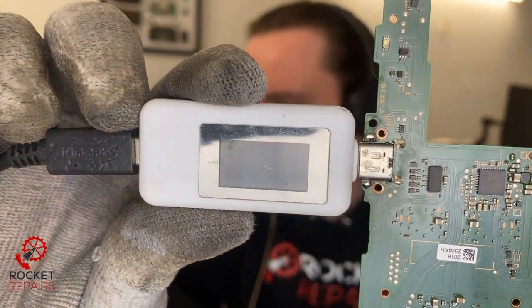Let's test. What we're looking for here is charging on both sides of the board at 15 volts. This side — yep, 15 volts, 0.032 amps. That's good. And the other side — yep, perfect. All right, 15 volts both sides.